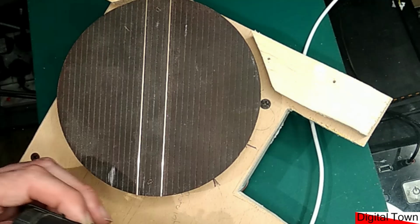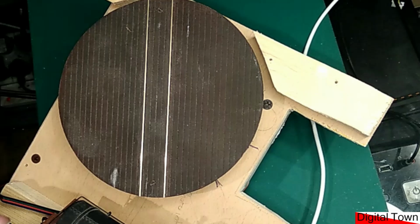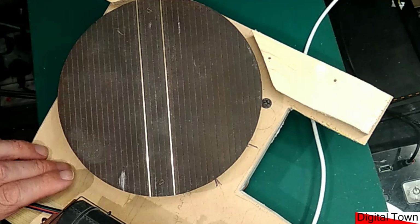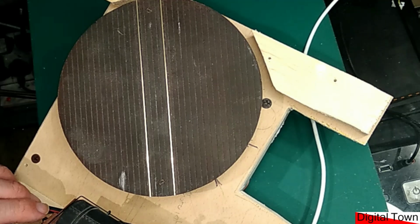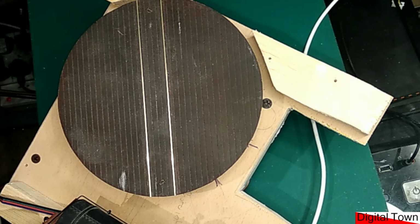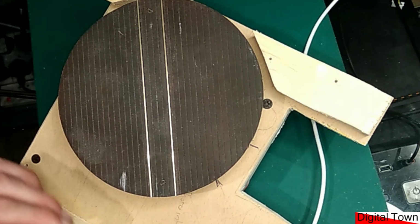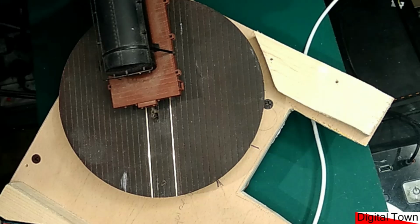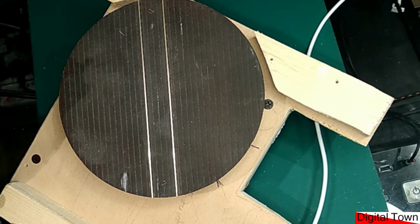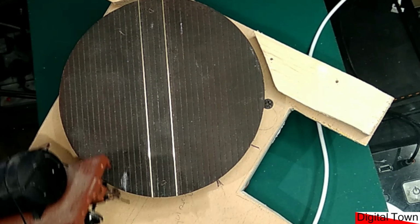On a later version of this that I built just for a traverser, what happens is when the project starts up, this doesn't move at all. It just waits until a command is given to move it to its first location, because if I'm running the railway correctly, I've obviously looked at what I'm doing before I press the go button, and I'm not going to tell it to rotate if there's something halfway over. So again, that is thinking from a fail-safe point of view: how is this project going to work in a safe way?